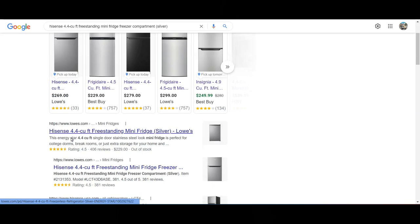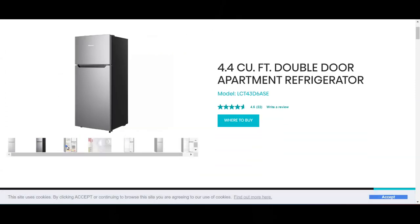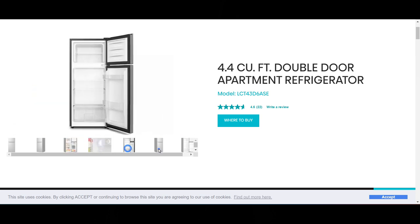I didn't troubleshoot this, but the owner did say he smells ammonia — pretty good indication that it needs a cooling unit. I already ran through the repair scenarios with the owner. They live in this trailer full time and they need a refrigerator. I recommended pulling the refrigerator out and putting in one of those smaller garage refrigerator-freezer combos — it's like $300 to $400 — whereas the cooling unit by itself is going to be double that. But they insisted they wanted to still use it on LP mode because this is a gas absorption refrigerator, so they opted for the cooling unit.